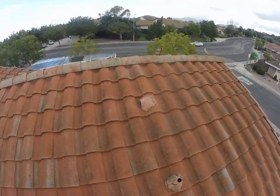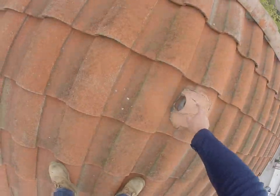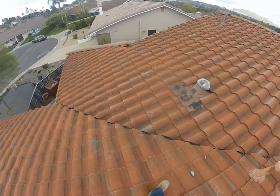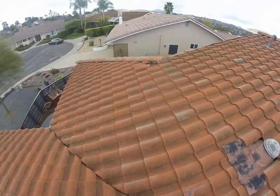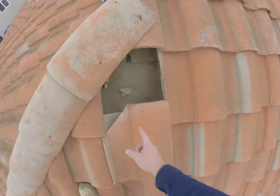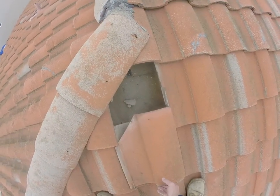It's amazing that this thing stayed waterproof as long as it did — I don't know how that's not leaking. Wind-driven rain is definitely getting in there. This tile was sliding out of place; I moved it just to get a better look at what the felt looks like underneath, and yeah, that's definitely original felt.